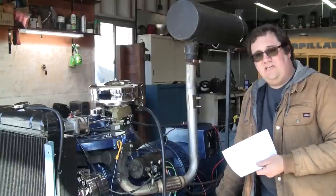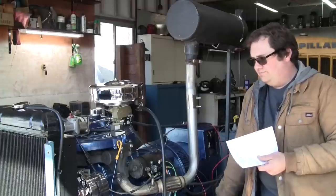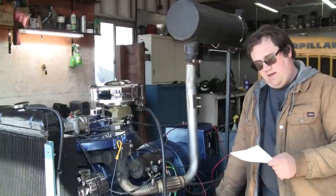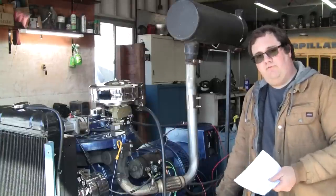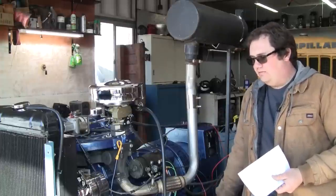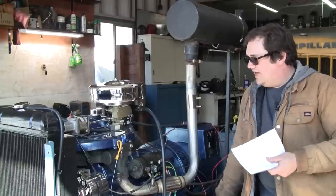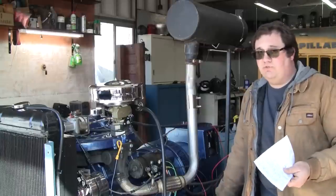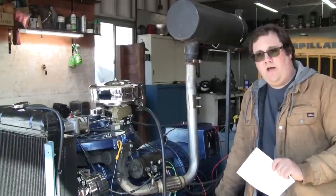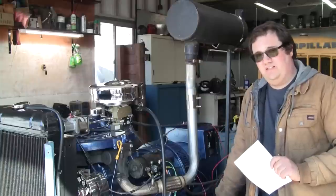Second, with a gasoline unit, you really don't have the issues with light loading that you do with a diesel. No issues with wet stacking, especially on the older mechanical units. Readily available fuel. Gasoline, you can pretty much find it anywhere in a hurricane situation or a storm or a power outage. Gasoline's easy to get a hold of. Same with diesel, though. It's quiet. Gasoline units tend to run a lot quieter. I should say any kind of spark ignition unit tends to be quite a bit quieter than a diesel.